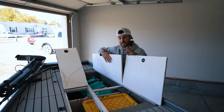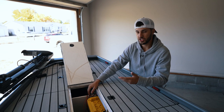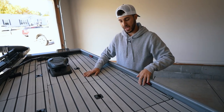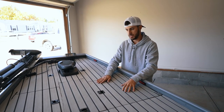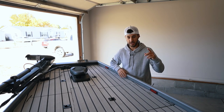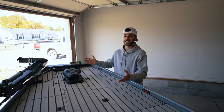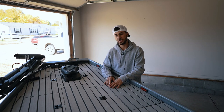These are our compartments — a lot of you guys were asking about dividers on the inside. Eventually I'm going to put dividers in there; I have one right now but it's makeshift, giving me two giant compartments. I used cheap Amazon weatherproof latches for the edges to open and close them, and the handles were also from Amazon — about four bucks a piece. The PVC is not as soft as you'd think. I've had three people in this boat: me, my girlfriend, and my buddy Tyler, who is six foot four and roughly 220 pounds — and we didn't break anything. If you have a good frame you don't have to worry about sponginess in your deck.